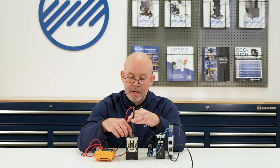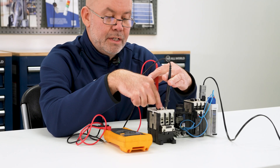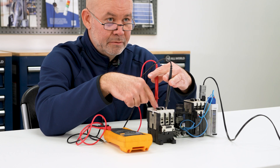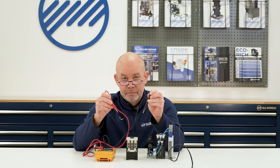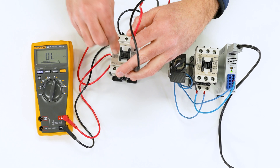We do that with the next set of contacts, and in this case I'm pushing down the actuator in the front and I have an open reading. That means there is a failed contact in this contactor — we have no continuity through that contact, which could be broken or severely burnt on the inside to where we are not conducting electrical current through it. At that point, this one's done. But check the third one anyway — we have 0.1 ohms, which is a good reading.